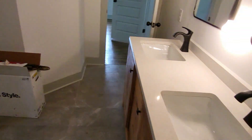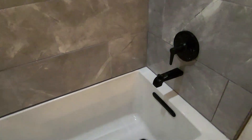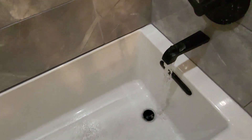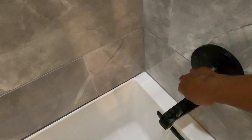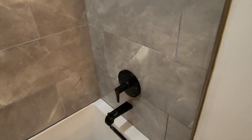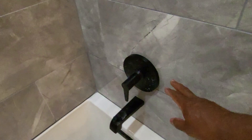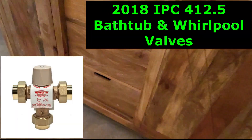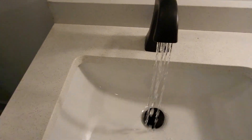This is a master bathroom with dual vanities and a tub-shower combination. I run the water, make sure there are no leaks around the shower valve or the shower head. This particular setup — if it were a two-handle bathtub setup I would need a mixing valve, but this single-handle unit is considered your mixing valve. They'll typically put mixing valves under the sink on the lavatory as well.